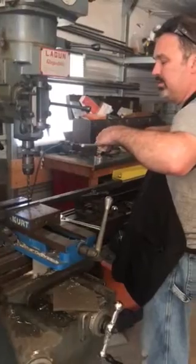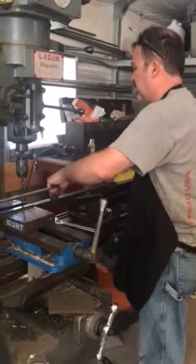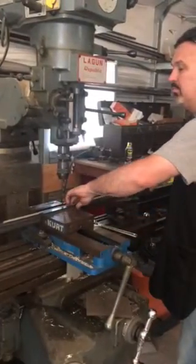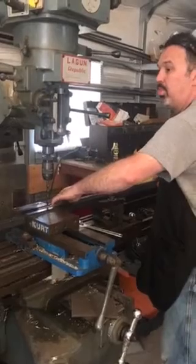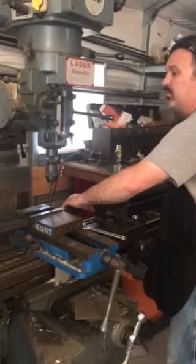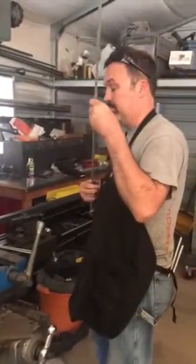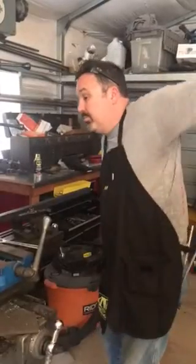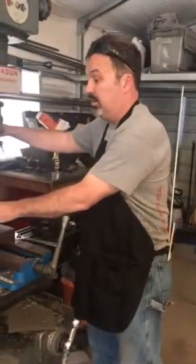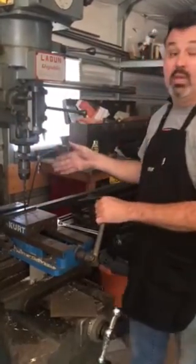Too many extensions in there — let me fix that. I loosen up my clamp, get a mechanical stop against my vise, and lock it back down. I realized what I did — I put two 2-foot extensions together instead of a 2-foot and a 1-foot. And you can see that hole is exactly lined up where I drew it and pre-drilled it.